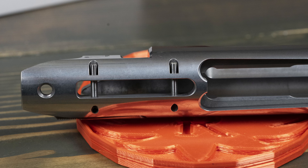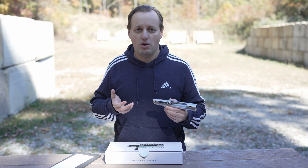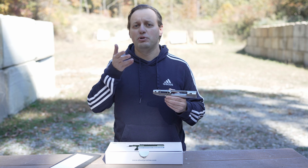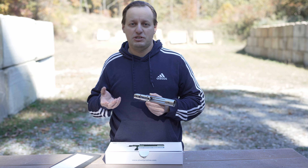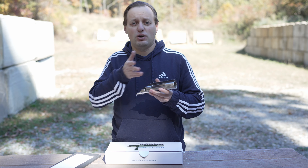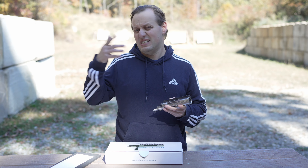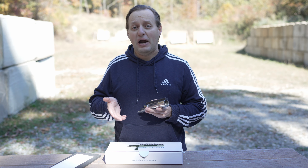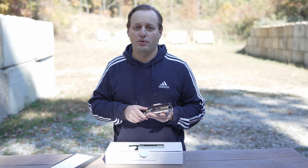On the bottom, you have two pins that will hold your choice of Remington 700-style triggers — no fancy trigger hanger system here, which you find in some other actions. However, this also means better chassis compatibility, as not every stock and chassis has clearances built in for hanger systems. The Pristine action, despite its Remington footprint, is threaded for Savage small shank pre-fits — 1.055 inches by 20 TPI versus 16 TPI on Remingtons. Quite a few barrel companies make pre-fits, and any competent gunsmith should be able to spin one up.